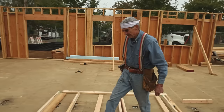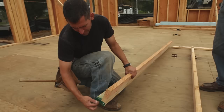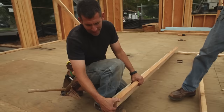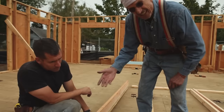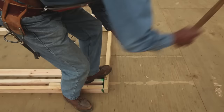There are other ways to make a corner. Let's see how Scott made his corners. Here we have a 2x6 wall coming in to tie in, so we need to use a 2x6 on the flat, nailed in an L-shape with the end 2x4 of the wall. That allows an inch and a half of the 2x6 to stick out on the other side, and sheetrock ties into that corner. You nail it together in the L, making sure it's flush on the outside, then lay it in your wall. The good part is it actually saves a little bit of wood — it just takes two studs and you've got a corner.